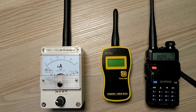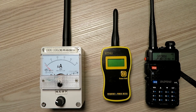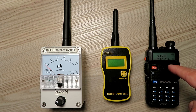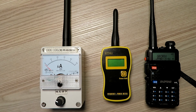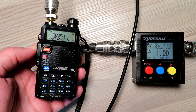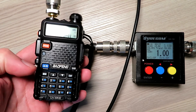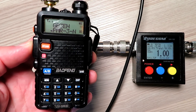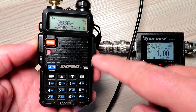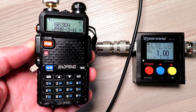We know this is definitely a PMR radio — this is half a watt, 100%. So we'll set the UV5R to low power and see what kind of output that gives. I reckon on low power these are about a watt and a half, which is the watt-and-a-half equivalent to UHF versus 27 megs — that's what I'm trying to achieve. On high power the UV5R is putting out 3.7 watts into the dummy load; switching to low power gives 1.3 watts.